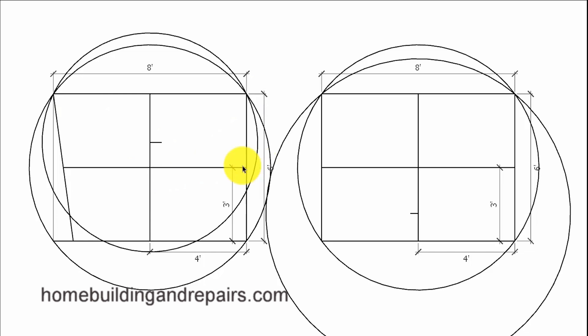You don't need to go from the center of this side here to draw an arc — you can move it up. If I move it up and measure from this point to this point and use a smaller radius, I'm going to get a smaller circle with a little wider arc to it. And if I move the center point down a little bit and use a larger radius, I'm going to get a more shallow curve. So you can change the size of the arc by simply relocating the center point of your radius.